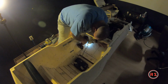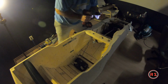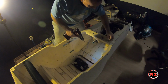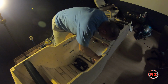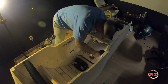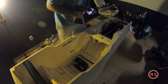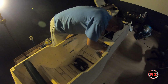As you can see, I built this part of the floor from 2 pieces of 3/8 inch plywood because I didn't have a piece big enough to make that floor in one piece. It's always best to make it in only one piece so you don't have a joint in the middle like you can see. Because of that, I needed to reinforce the piece with another 3/8 piece of plywood underneath it. So it makes a big piece. It's heavy for nothing. It's harder to bend. So if you have enough plywood, it's best to make it from one piece only.